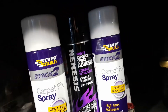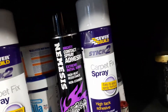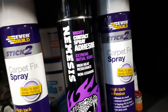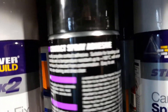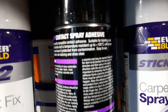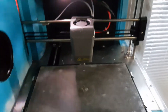Don't use regular spray adhesive because it goes off at around 60°C and just loses all its tackiness and actually liquefies. I also tried Nemesis adhesive from Screwfix, which is easier to find locally — it's high heat resistance up to 100°C. It probably works fine for up to 100°C and I've used it, but I ended up swapping back to the trim fix anyway.